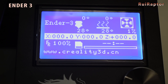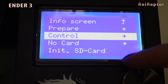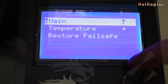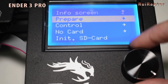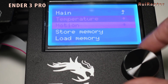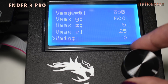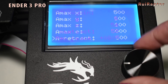The firmware is also different between both printers. On the standard Ender 3, you don't have many options to play with — most importantly, you don't have the option to adjust acceleration, jerk, and step values. On the Pro, you have all these options available. However, the Pro, same as the standard Ender 3, does not have thermal protection enabled, so you are forced to flash the firmware to have that feature.